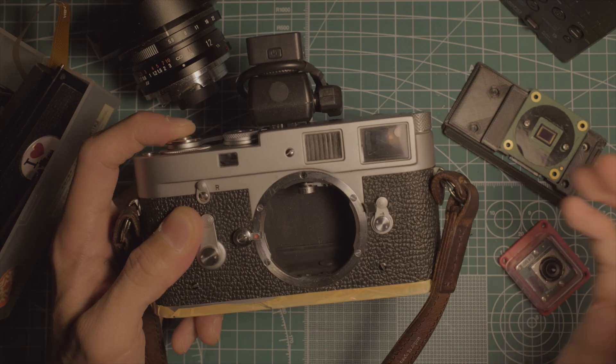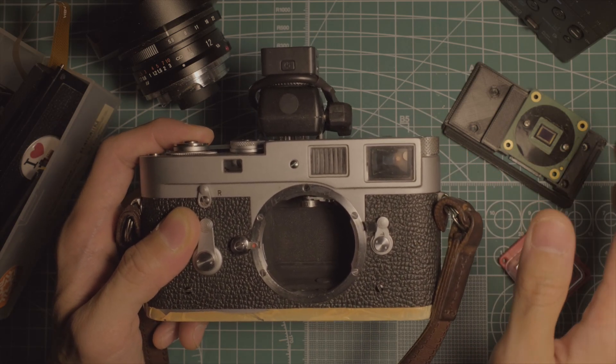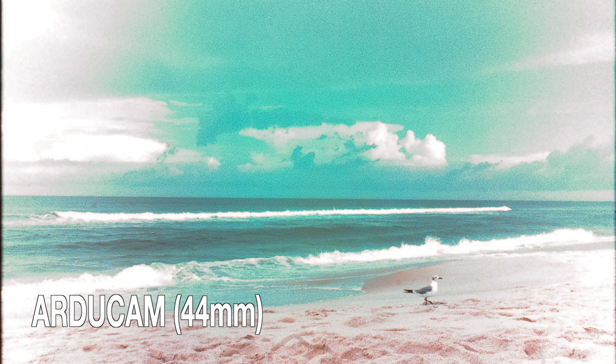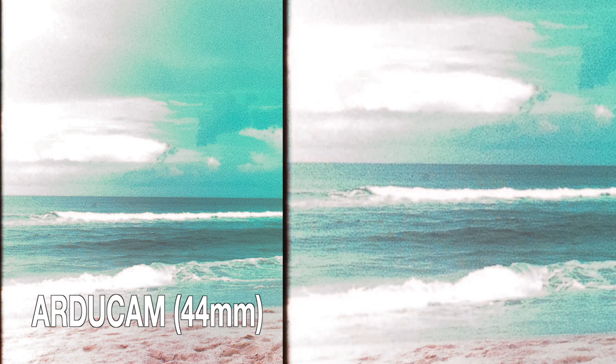On the original, I also had to remove the IR filter as it would get caught on the cloth shutter, which made it infrared and monochrome only in natural light. On this sensor, I had to remove a lens assembly, but it can take color photos in daylight. The sensor even captures its own edges, which look like film sprockets, and it's a neat aesthetic.